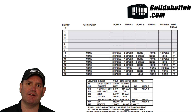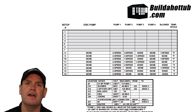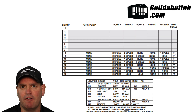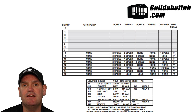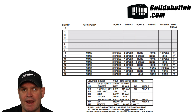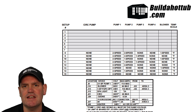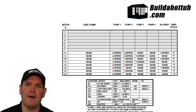You're going to need to look at the configuration tables in the PDFs — I'll put a link to that underneath this video as well. As you can see behind me as I'm scrolling through here, you're looking for either the model number you're replacing, because that will tell you which configuration you need, or if you can't find that, you can use the tables to identify what you've plugged in — maybe a dual-speed pump, a second single-speed pump, or an air blower. Find the kit you've got, identify the system setting number, and then set the spa pack to it.